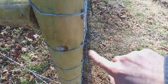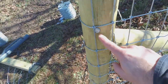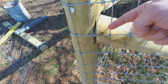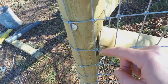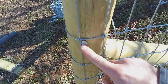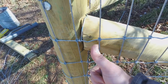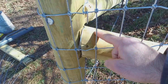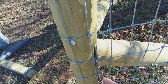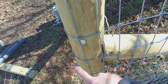Here you can see the spike for that brace post. I drill those down at an angle. I think this is going to be a really secure method. I see some floating braces constructed by drilling the hole straight down, but I prefer putting the spike in on this side of the post so that if there is tension pushing up on this post — which there is when you tension it — it's less likely to pull out and have your brace post fall off and lose tension in your fence. So I much prefer putting it in the back at an angle, so any tension that's pushing up will hold that.